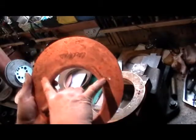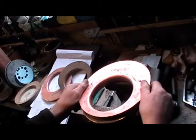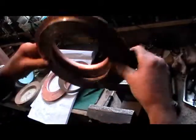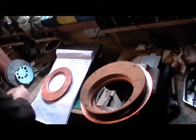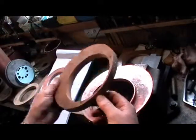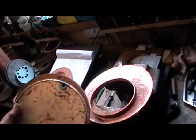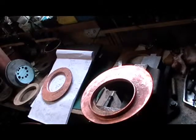Half inch above centre and six and a half inch centre to centre - I've moved my pegs on my former down to that position. I put my piece of copper onto the former and you can see it's concentric, ready to do this outside flange. I'll put the spacer on - as I've shown you in a past video - it goes on there. I'm putting this backing plate and screwing that on in four positions with screws, then I'm ready to form the outer flange.